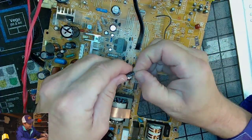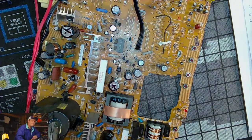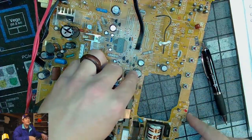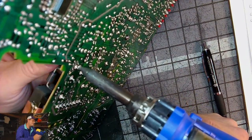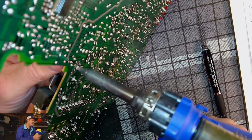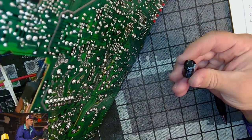All right, yeah, so we're looking at the Toshiba. See, this is a 50 volt 2.2. And we're going to remove these three around it that are larger now. Should be a little bit easier to get out of here than the other ones. That's just some nasty solder. This is the kind of solder you wouldn't even really want to reflow. And arcade guys know about that. Sometimes you just have to remove all the solder. It's just ridiculous. 35 volt. So this should be 501.